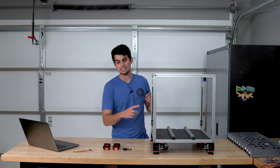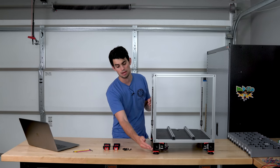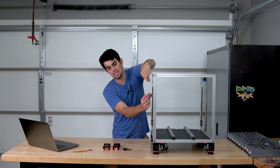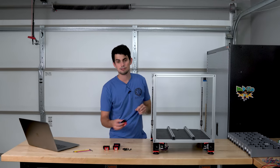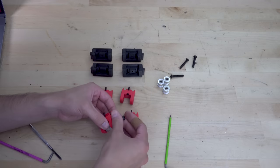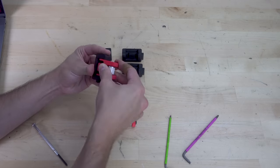The four main Z-axis belt loops are going to travel through their corresponding Z-drive, but they need something at the top of their travel in order to keep the belt straight. Enter the idler assembly. Now this is pretty simple. It basically just holds onto a smooth idler, which is a pulley that rides on bearings and can spin freely.